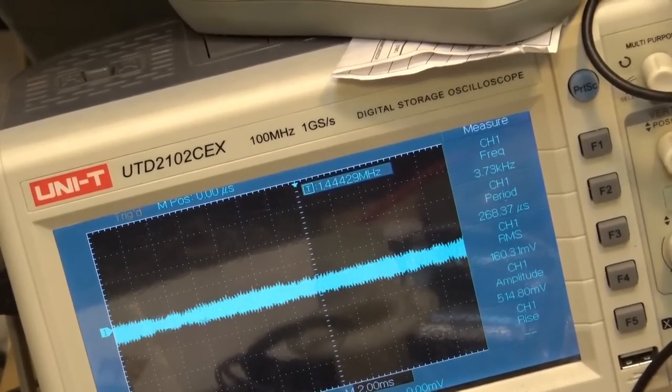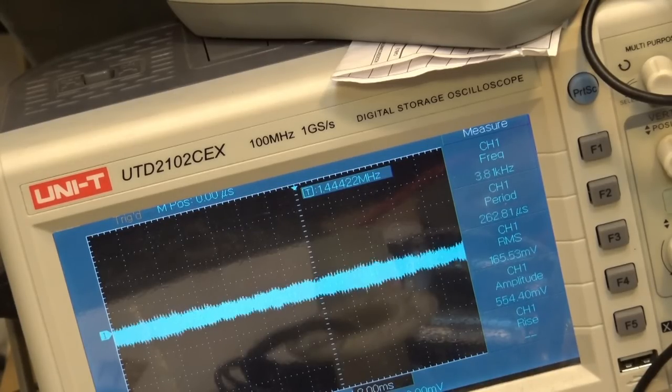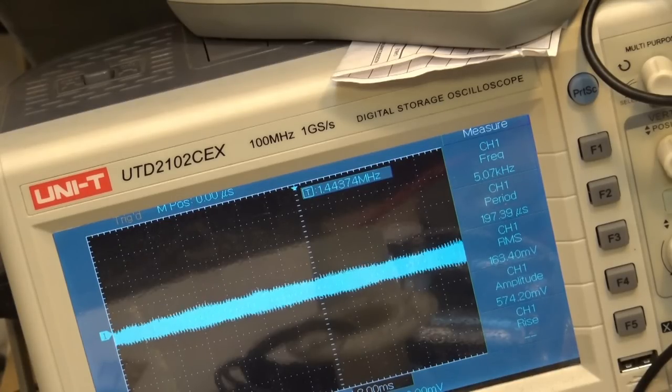So of course this is where the digital scope comes in handy, and if you think you're seeing some RF on there, well, actually you are. I'll show you. I have my little 1440 kilohertz AM stereo transmitter turned on right now, and in my workshop here, even though it's a 400 milliwatt signal, which is enough power to make it to about the end of the block on the AM band.